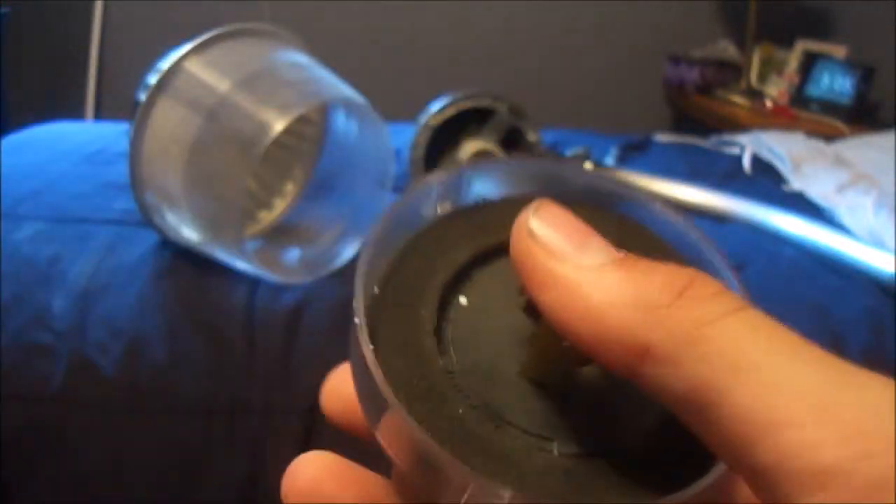You can see it says time delay up to two minutes, because this thing is really slow at sensing light. These also die out after about 12 years, so you're going to have to replace them — that's why they sell replacement units. Some of them come with a completely covered top and just a little window for the photo cell, but this one is completely clear so you can really see what goes on in there.